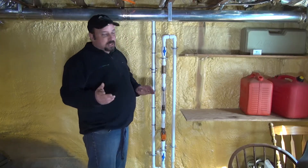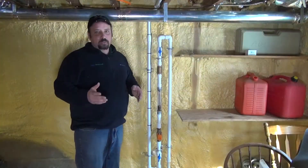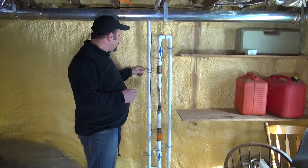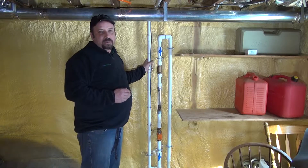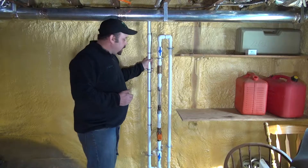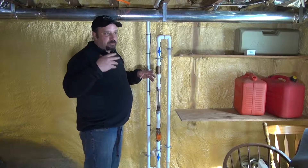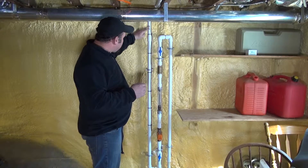In this particular case, this is going out to a dry well in the ground. In most open-loop applications, when water gets released from your water well it needs to go back into the ground. From an environmental standpoint, you really do not want water bleeding out into wetlands or woods. If you're going to take water out of the ground, it should go back into the ground. So the water moves through the supply system, comes back on the return system going back to your well, and some of that return water is taken off and runs through this pipe.